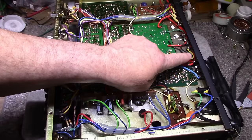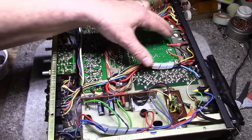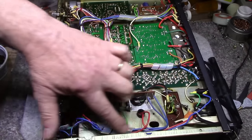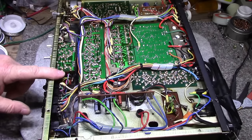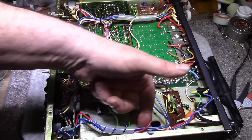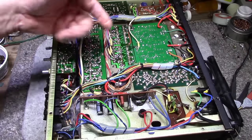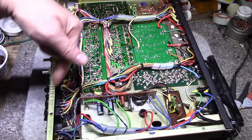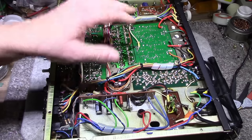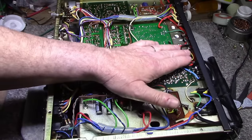Like I said on the last video, what I did is I rerouted the wires from the power amplifier. They ran down underneath here, around by this power, under this channel, all the way up to the front, and then went to the switch, and then it ran back again the same path. It came back down to this side channel underneath all this power wiring, back to the speaker terminals. And I eliminated all that, and I went straight across from the switch to the back, made the wires shorter and heavier gauge, so that's why we see such a huge reduction in internal resistance.